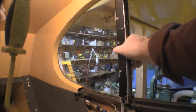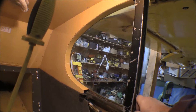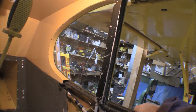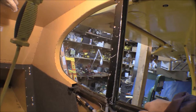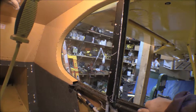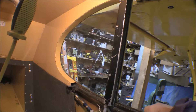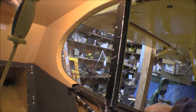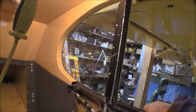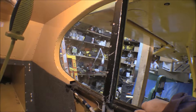I've got this cover here over the window and it's kind of frozen in there. The metal on the fuselage gets rusty and sweaty, swells up, and the aluminum gets a little corrosion in it and swells up. It's a pretty tight fit in there anyway, and then it's almost impossible to get those out of there. I used a little putty knife to slide in and out of the groove between them to try to loosen it up. I'll have to work on that some more and maybe squirt some ACF-50 in there to get it to loosen up.